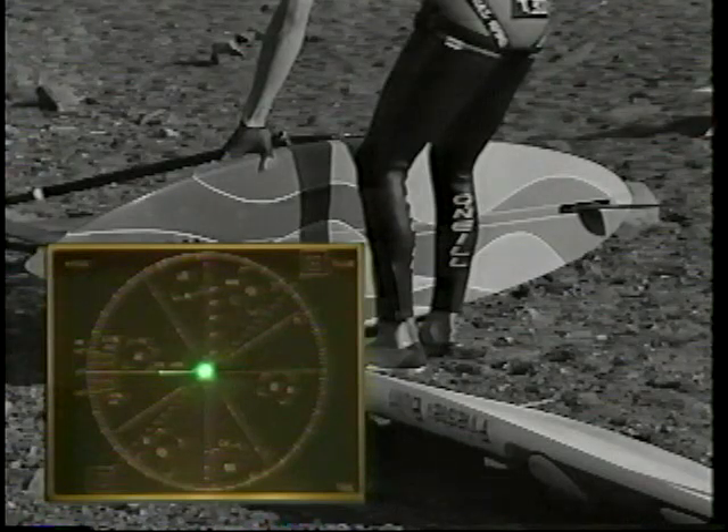Here's how a black and white picture would look on the vectorscope. It looks this way because vectorscopes are used to measure the chrominance or color portion of the signal. The way this color information was added to the black and white signal was by using a sine wave. This contains the color burst reference, which is off screen right after the sync pulse. The sine wave during active picture has different phase angles and amplitudes to get different colors. The vectorscope decodes this portion of the signal to provide us color information.